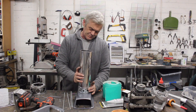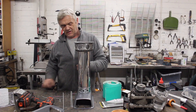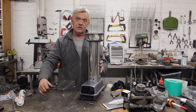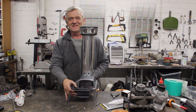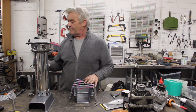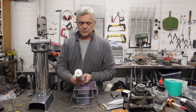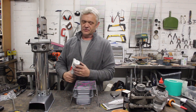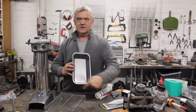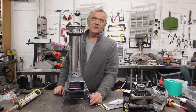Now we've made all the parts, we put them together — it's pretty much just stacking them up. The sections bolt together with the grate in between: the ash pan on the bottom and the top chamber above. We wire them and seal with a high-temperature silicate putty — not silicon, it's water glass, rated up to 1200°C, bought from B&Q. We put sealant around the joints and bolt the two halves together, then give the sealant time to dry before lighting it up.